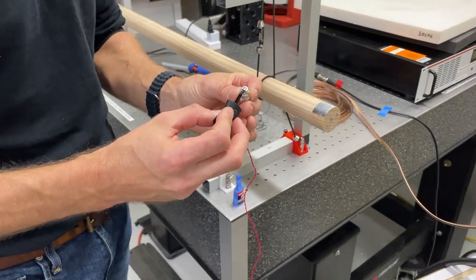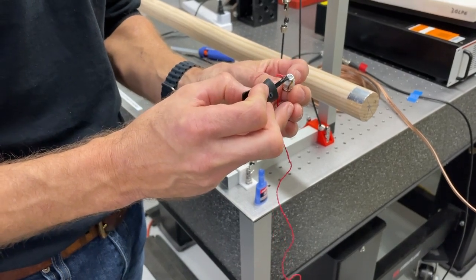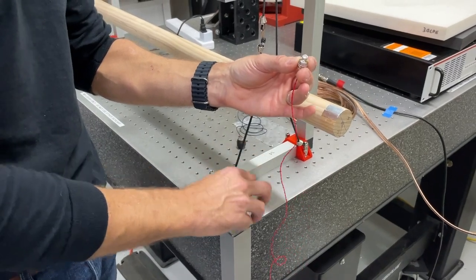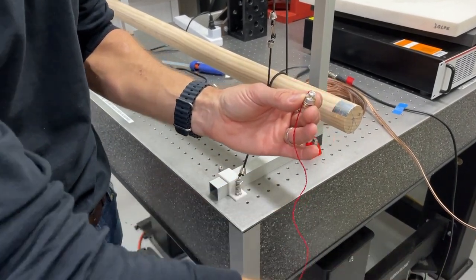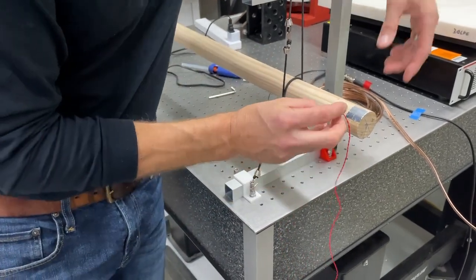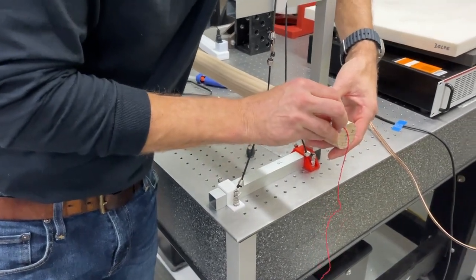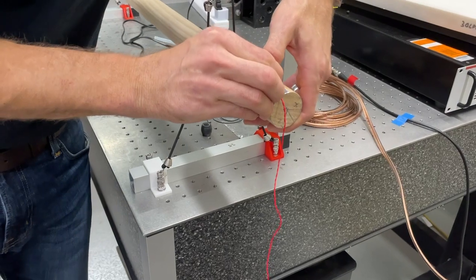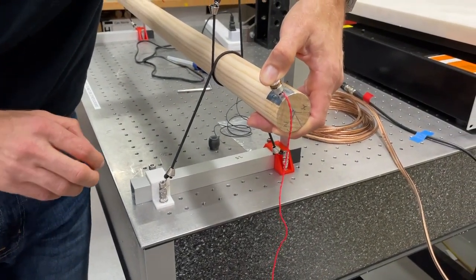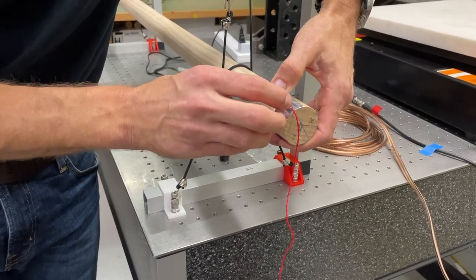I've got some super glue here, and we really just need a very small amount of super glue around the ring here. We don't need to fill up the hole with super glue. Super glue works by putting one very thin molecule of adhesive cyanoacrylate between the two metallic surfaces. And this is obviously a flat surface, this is a cylindrical surface. So I'm going to mount this carefully, and we're going to essentially have like a point contact. If we just use a small amount of super glue, it should go off pretty quickly if we apply some pressure. And that should hopefully stay in place.